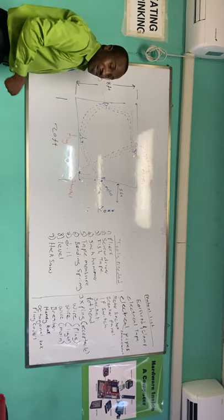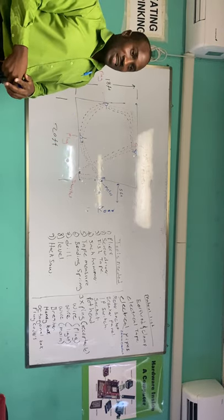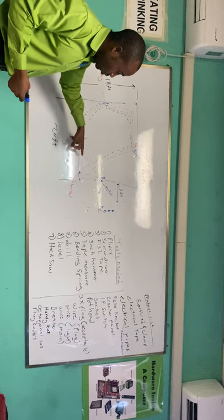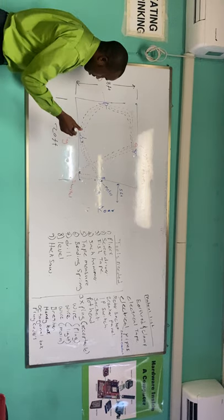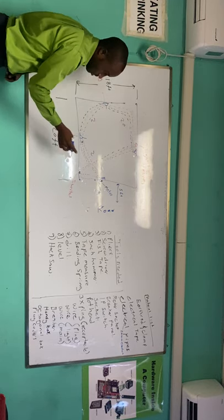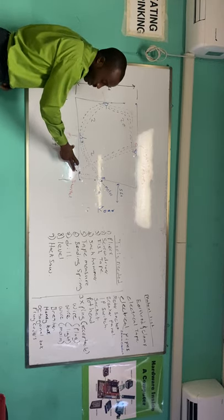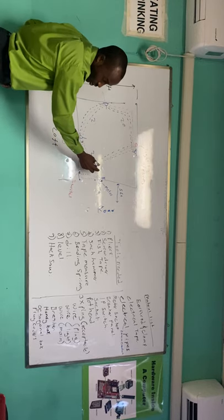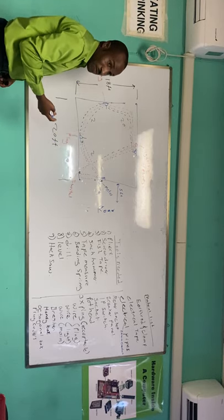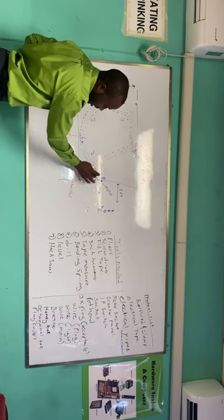I'm going to put the three wires bunched together in the pipe — not one wire per pipe, but all three wires bunched together. So you have two lengths of pipe here, another two here, and another two here. Why? Because if this is 20 feet and the plug goes in the middle, this section is 10 feet — one length by itself. You might cut it shorter here, but you'll still need more than one. So: two, four, six lengths for the plug circuit.